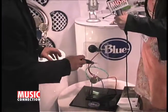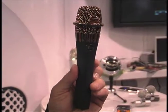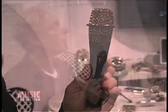Then you get into our active circuit in the Encore 200. As you can see, this is a burnished bronze finish on the grille. Same steel reinforced grille, but this has our active circuit in it. We call it a phantom-powered circuit that allows you to keep the impedance constant, which means if you run this at about 300 feet of cable, it's going to sound the same as if you ran it with 25 feet of cable.